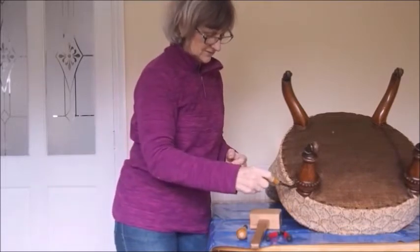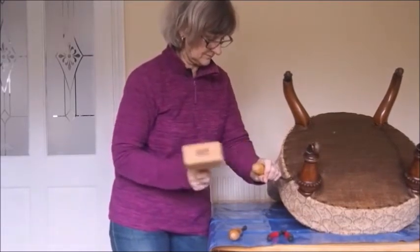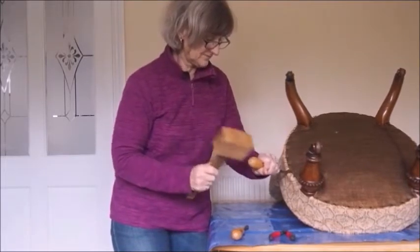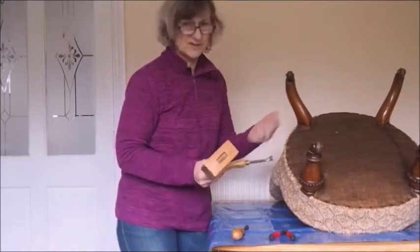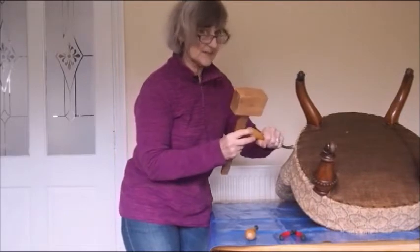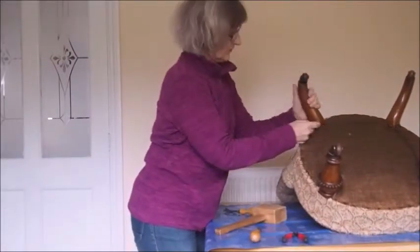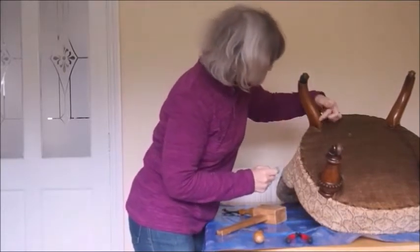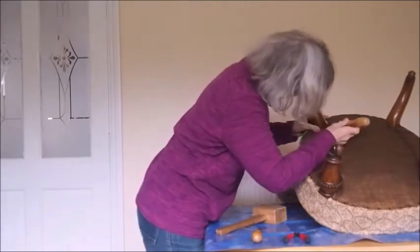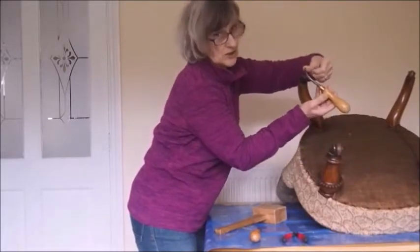Just use your ripping chisel, tap with a mallet and if you're lucky it comes out. Be gentle because you're bashing it against the wood. It's very tempting to rip everything out quickly, but you've still got to get those tacks out and it's easier to get under the fabric. If you get a stubborn one, go in at a different angle - but be careful. When you get to the leg there's this beautiful piece of wood which I'm going to polish anyway - be very very gentle and careful not to cut into or damage it.